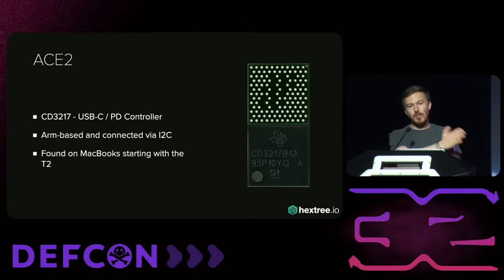Easy plan: we start recording on the HackRF, reboot the ACE3, the HackRF gets triggered by the chip select line, and we get a perfectly aligned recording. In theory your desk should look organized, but in reality it will just be a gigantic mess. In the end, we have perfectly aligned recordings and can average them together to get a nice meaningful signal — anything else adding noise we can just filter away. But now we just have a fancy line. How do we actually use this to time our glitch?